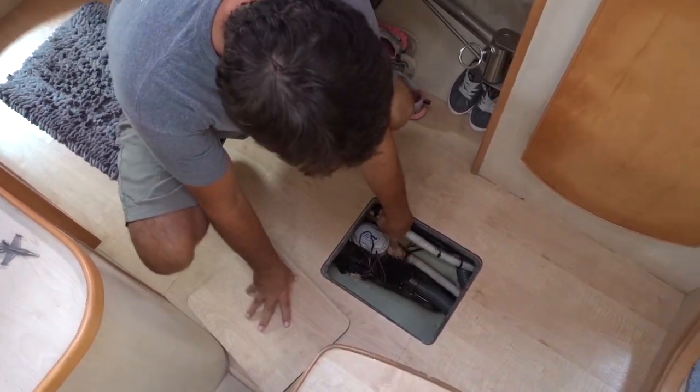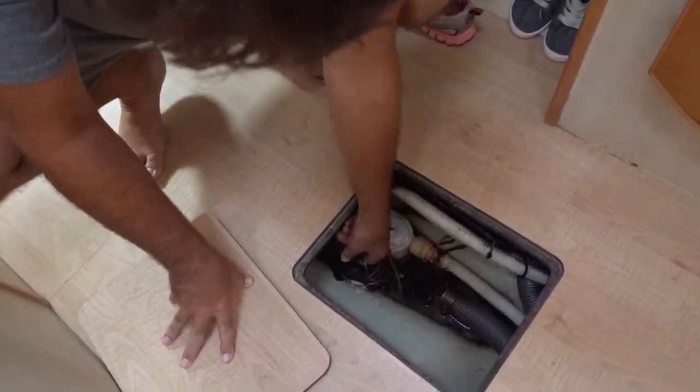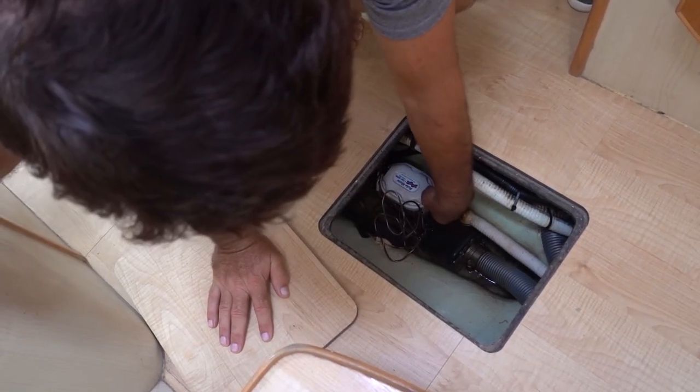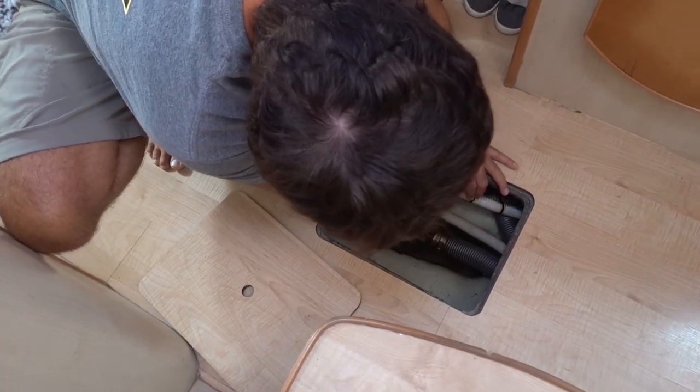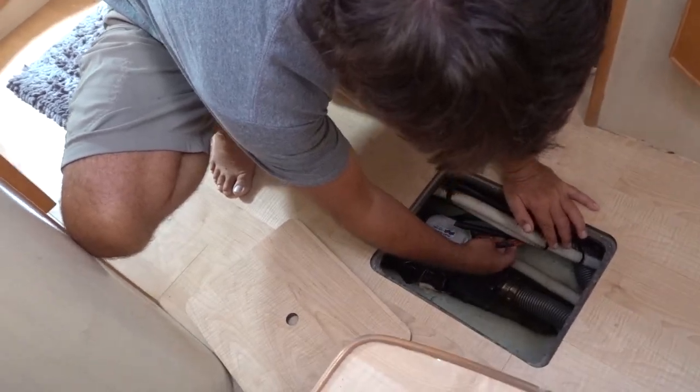The only time we really get water in the bilge is when we shower — I think we have a loose clamp on our shower box — and when we fill our forward water tank on the starboard side. Obviously we have a bad connection somewhere, a loose clamp or a bad hose, and that's a huge job to run. But in the meantime we need to get this bilge pump pumping it out instead of pumping manually. Whenever we get water in here it is clean water, coming either from the shower or from the water tank, but it still needs to get off the boat automatically. So we're going to open up our bilge — we've got our manual pump and our automatic pump and all the wiring down here is just a mess. We need to take this bilge pump out, disconnect it, and trace the wires back. This runs into a harness and that's what makes it fun, because we've got to chase that harness back and find out where the power is.